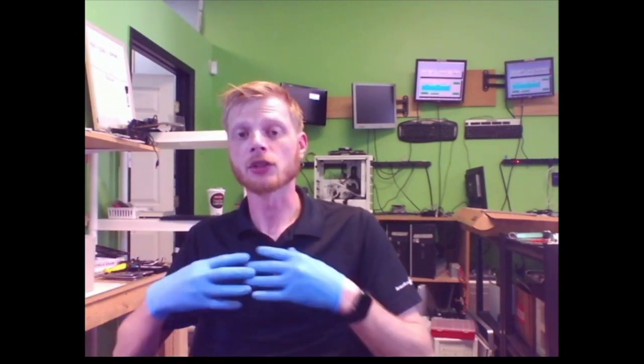That's bad. Since the capacitor is not shorted internally, but it does read as a short, the battery is going to go into what's called protection mode, which is going to be at 0.00 volts. I'm not sure if it's protecting the device or protecting the battery from blowing up, but it definitely helps in cases of liquid damage, because it shuts off the device, and that's exactly what you want to happen. You do not want power running through the device while there's liquid in it, obviously. Alright, with that being said, let's go ahead.